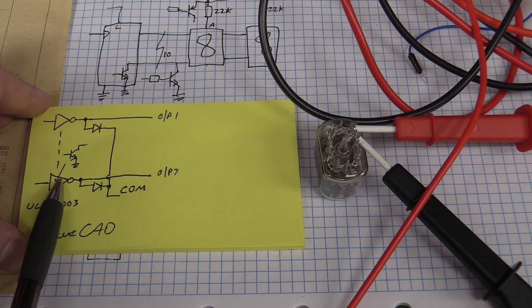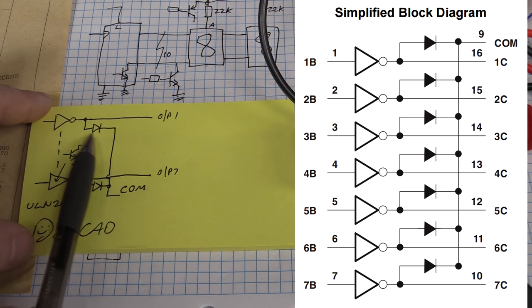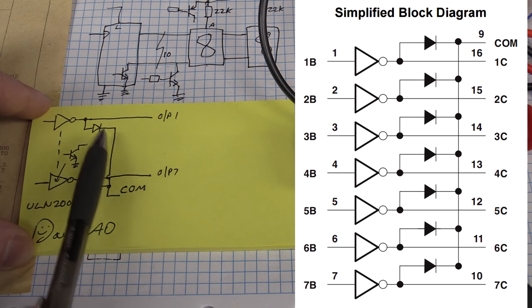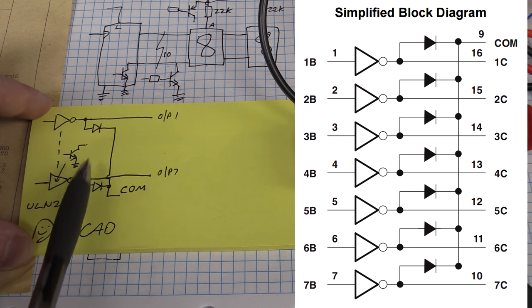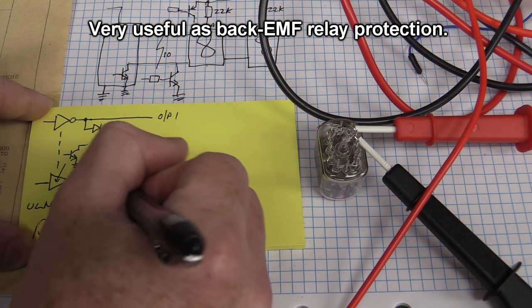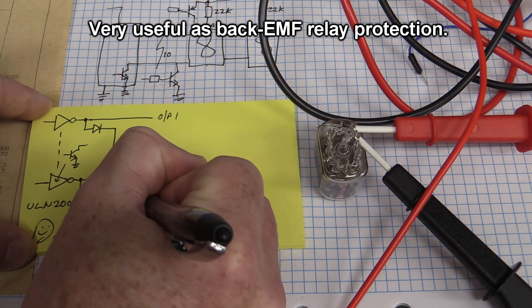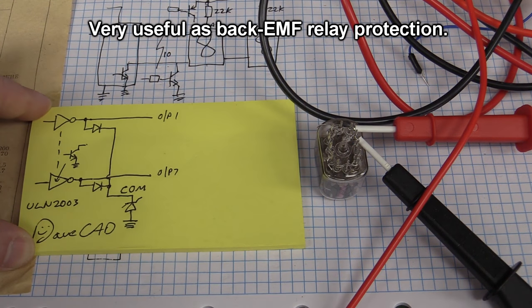And inside each one is an open collector driver transistor, a high voltage type, but in this case, high voltage means 50 volts. 50 volt maximum rating, not good enough for our Nixie tubes on its own. But if you have a look at the internal structure of these things, then they've also got a common diode array on all seven outputs, tied together, and then it goes to the comm pin. So, aha, what we can do is hook this up to our zener diode clamp like that,